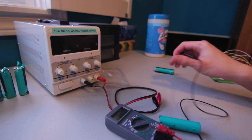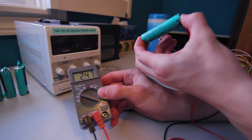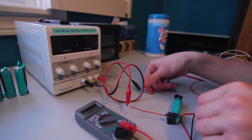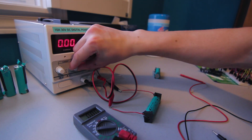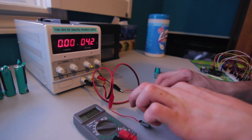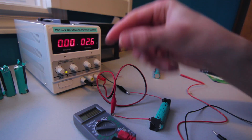This will be our first test: 2.47 volts, which is actually pretty decent. These batteries shouldn't be below 2.5. Power and ground — let's hope the battery doesn't explode. The current is still zero, it's at constant voltage. There's no connection — whoa, it just went to like four amps. I'm going to turn the current all the way down and slowly bring it up.